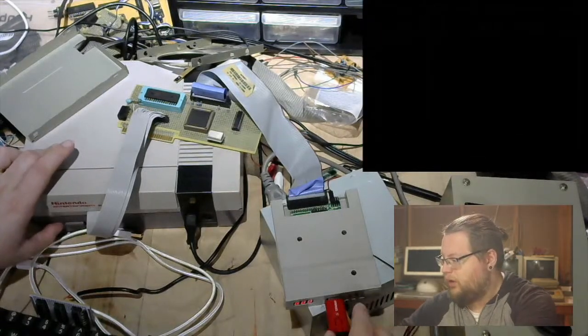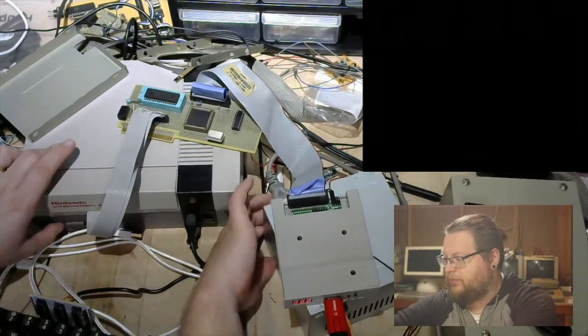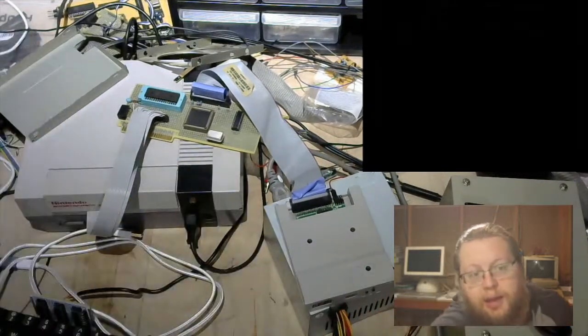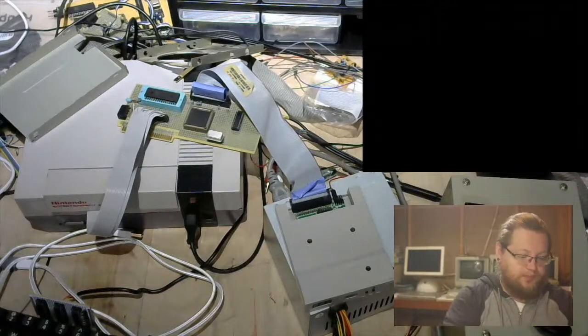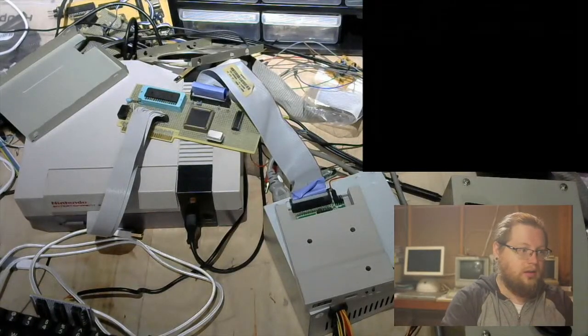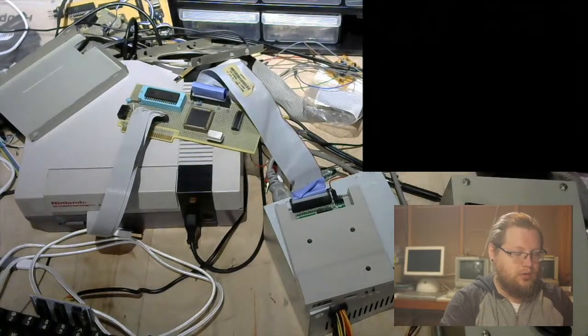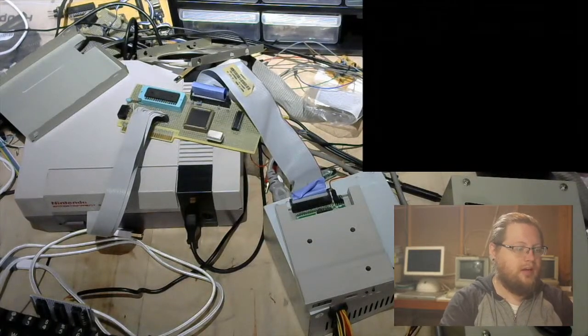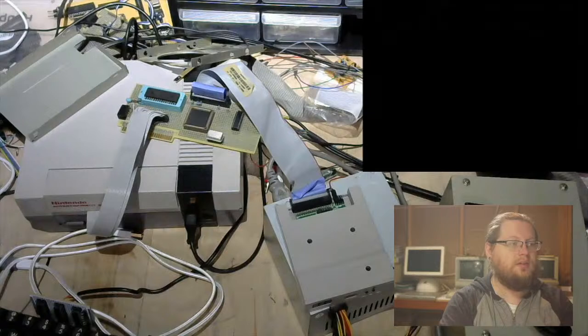Super cool. All right, well then, let's power this bad boy down and pull this bad boy out and start up an XVI32 session and edit some disk. What am I doing? Open with XVI32. All right, so instead of that halt loop, what we need to do is literally it's just going to be a break, which I'm just going to look that up like a real hacker. Not even going to assemble it. Who needs that?